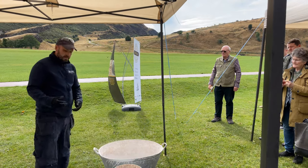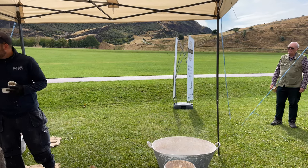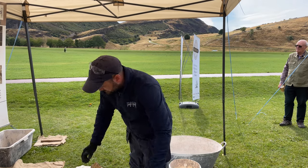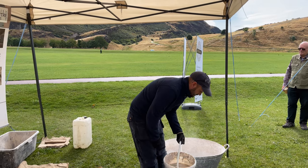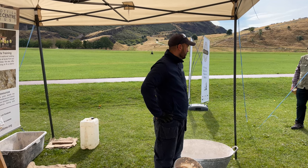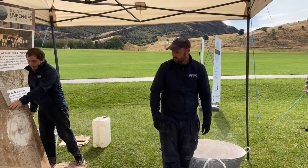For harling materials you need your sharp concrete sand — important for texture, not only for your pricking-up coat, but to fill out the second coat and give your texture for your final coat to help evaporate moisture content. I have this lovely nine-year-old mix here. Harling is a messy job — you can try to be as neat as you want, but you're going to end up head to toe in harling. You have to throw the material at the wall because you need that texture finish.